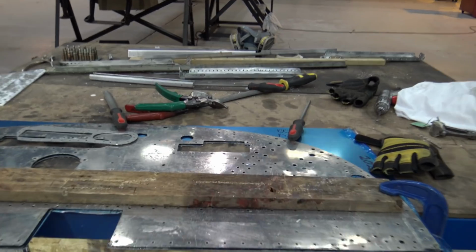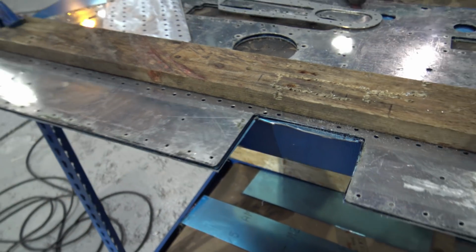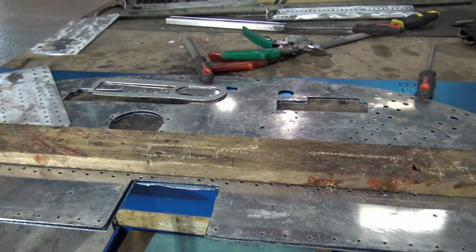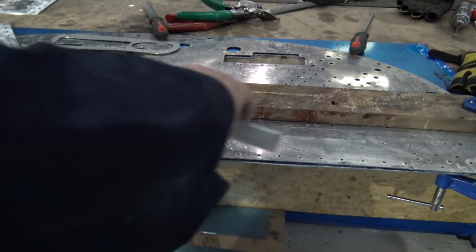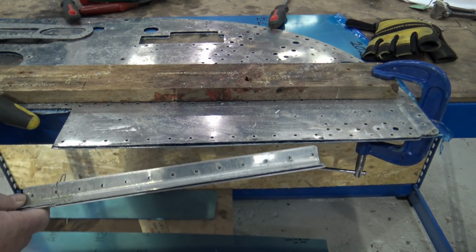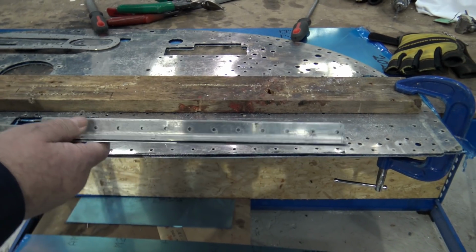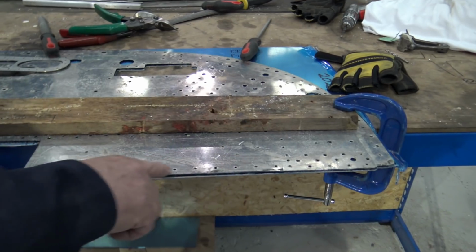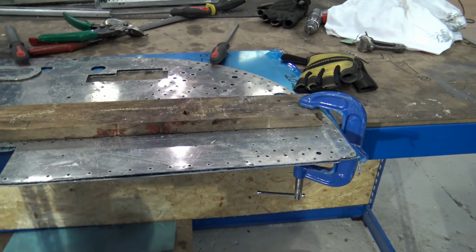So, will you be able to drill these holes through as... Will it be in the correct place? Well, it's a bit of both, because this is a new one, you see. There's a new one to go there. As I'm making a new plate as well, I'd rather position it correctly and drill new holes, then use the old one once you start drilling through and make it match. The unevenness gets passed along and things like that.